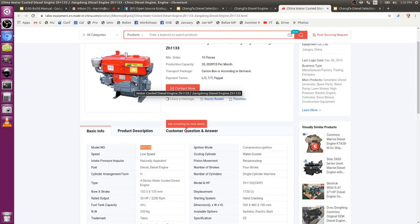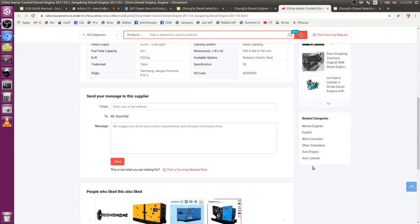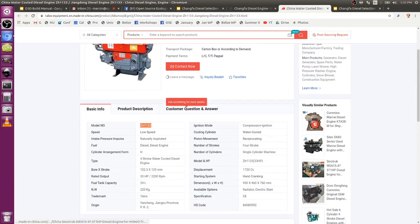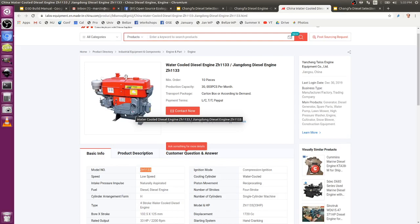But whenever you're working an engine, you've got the potential to get a lot hotter. Like, I drive 18-wheelers. Going down the road, my truck runs 180 degrees, but as soon as I climb a hill, it goes up to 210 degrees. It's the same thing with a micro tractor, skid steer, or bulldozer: when you go to pushing dirt and really put it under a strain, that temperature is going to shoot up. I think that's where the evaporative cooling would fail. So I think water cooling with a fan would do a lot better. Yeah, so I pretty much have to plan on radiators for these.